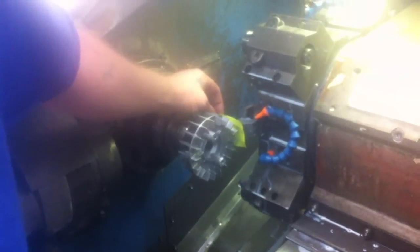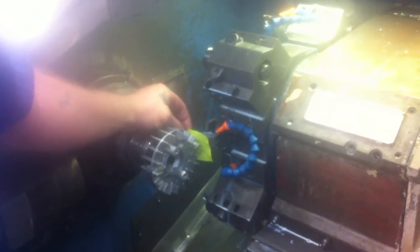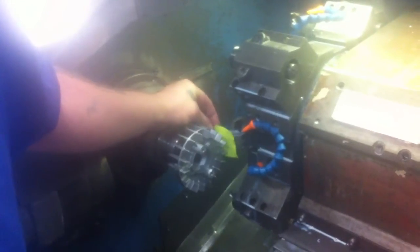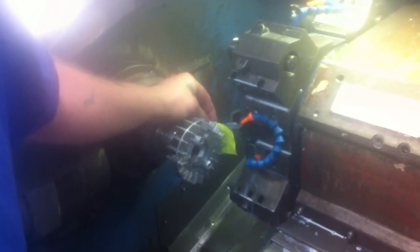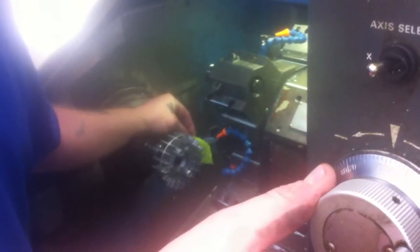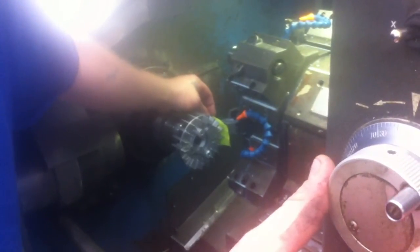What I'm gonna do now is take the tool, and in between the tool and the part is a piece of paper — that's about four or five thou thick. I'm gonna touch off the tool until it grabs the paper. Okay, so we're grabbing.